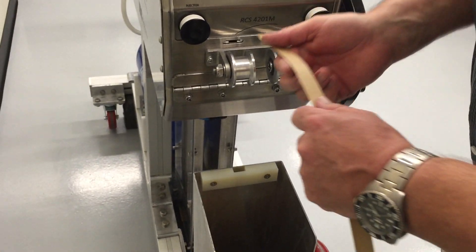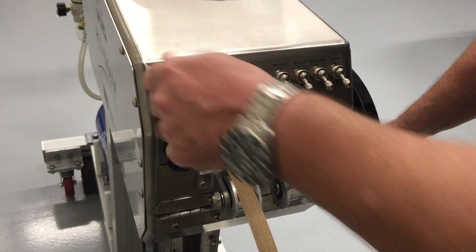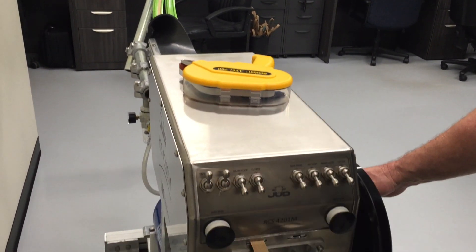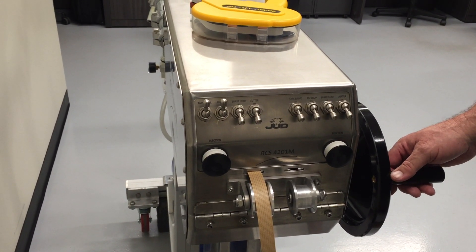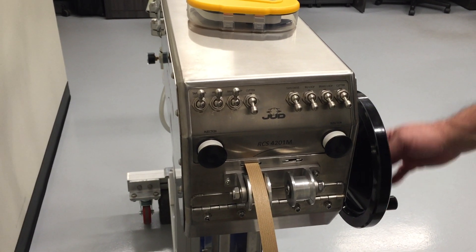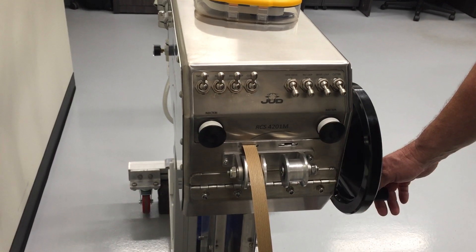The simple four-step procedure is: First, turn the tape drive switch on — that allows us to drive the tape out to the nip area. The next switch forms an injection loop, which allows us to have enough tape to reach the nip when the primary arms are rolled over. The third switch allows us to make a brake loop, which gives us enough tape to make it all the way across the sheet as we do a turn-up. The last switch cuts the paper band and allows air to flow to the injection button.